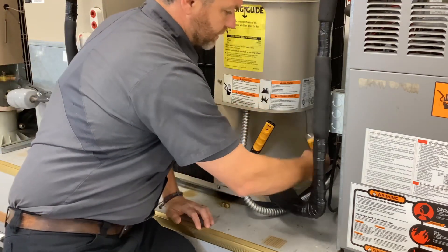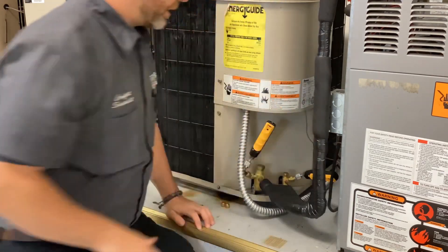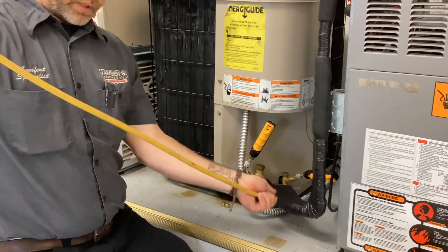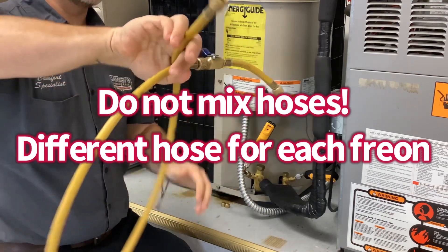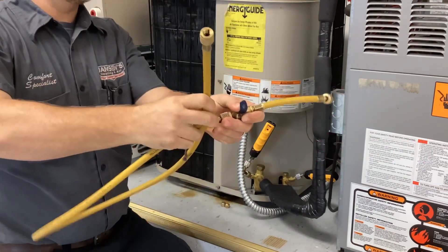Discharge is red, so that's your liquid line — put that probe on there. You'll notice with the probes there's not much of any blowback whatsoever, so that's always a good thing — that's why a lot of people like the probes. You're going to have to have a standard yellow hose with a ball valve on it, depending on what style of hose you use.